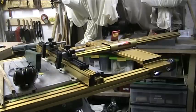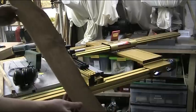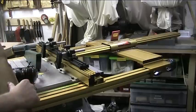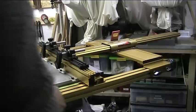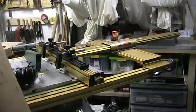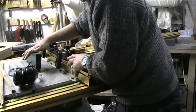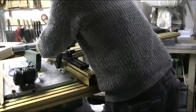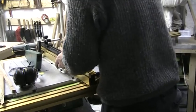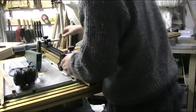Now I've got this piece of wood here. I don't know if you can see it in the camera, but it's quite thin and also with an edge here that absolutely no feather board could ever handle. So let's see if we can cut this. I've already estimated that I need a cut to take all of this horrible wood away — I need 50 millimetres. Now because of the blade protector, you're going to need to move these stock guides away from the blade protector. But this should be no problem at all because the stock guides will work at whichever distance you have from the blade, as they're always providing constant pressure.